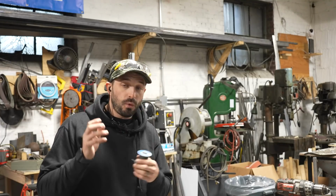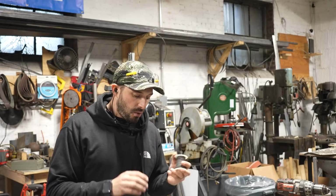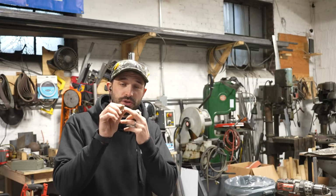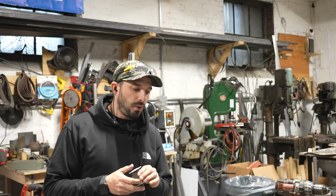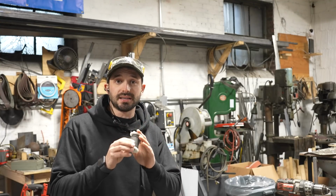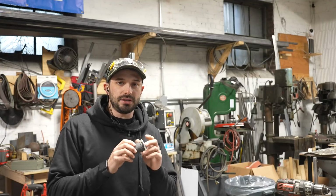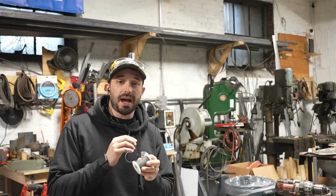For me, having a water jet here and a CNC and a laser, there's a ton of times where I could use this to, like I showed you with the little letters, clean out little inside profiles, clean out stuff on the water jet, get inside brass and aluminum parts. Now, these are aluminum oxide. They do make one size in silicon carbide, but it's very, very small. So for the most part, you're going to be using an aluminum oxide abrasive.